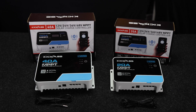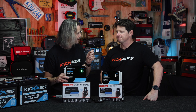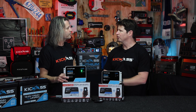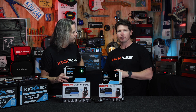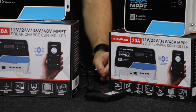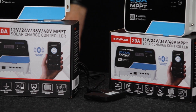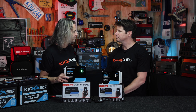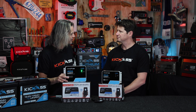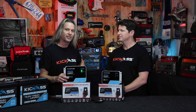We've also got this temperature probe here — can we quickly discuss what this little fellow does? That's for ambient temperature, Craig, to adjust the charge voltage of your battery. Depending on what the ambient temperature is, the charge voltage should adjust slightly, and that automatic compensation is performed by the MPPT controller based on the ambient operating temperature. So if you're stuck out in 40-degree heat in the outback with 500 watts of solar feeding into your battery banks and everything's getting warm, this little probe is going to tell the controller to calm it down a bit and protect the whole system.